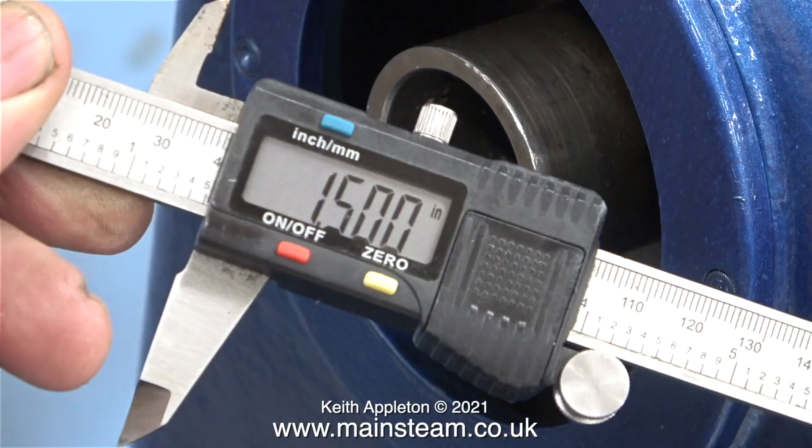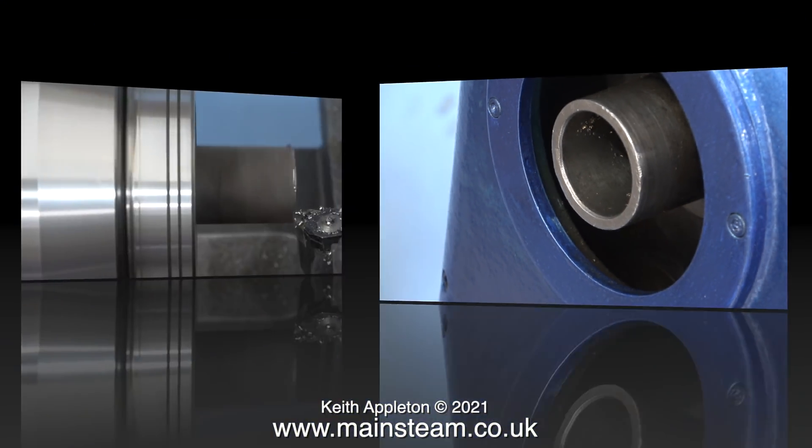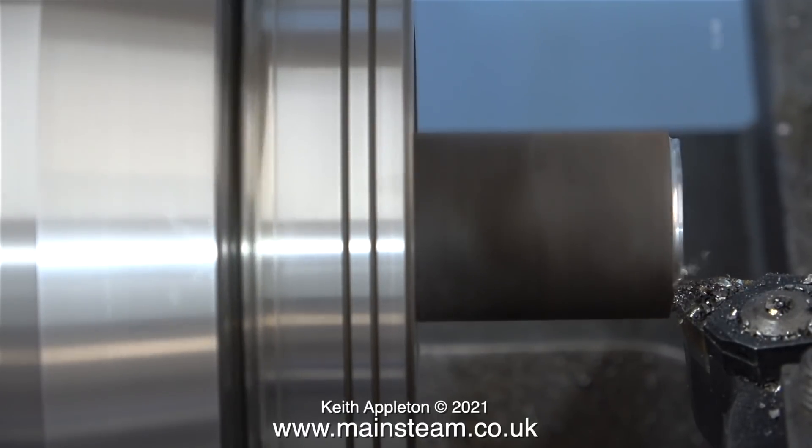The Smart and Brown is much bigger than my other two lathes and the spindle's internal diameter is one and a half inches — sometimes it's very useful to be able to turn large pieces of metal. Recently I made a replacement part for my son-in-law Robert's tractor, but the Smart and Brown wasn't ready so I used the Boxford and couldn't fit the part down the spindle, so it had to be done between centers and took a lot longer than it should have.